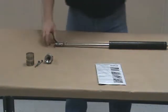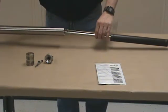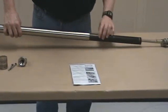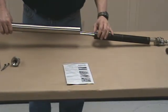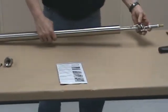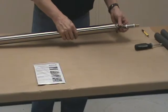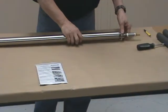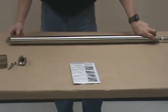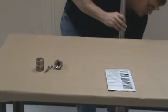Now the best way you put the pump body back on, slide it on, be careful not to hit anything as you slide it back on. You don't want to hit this pump float and jam it up in here hard. You want to make sure the pump body clears the control rod and control arm. Now the best thing to do, especially with a bottom load pump, is to stand the pump on its end, on its head.